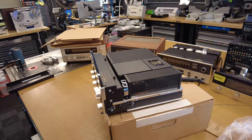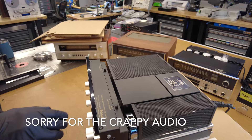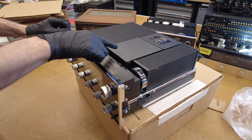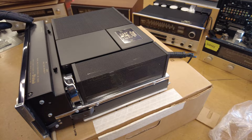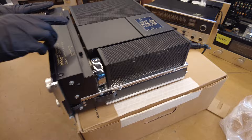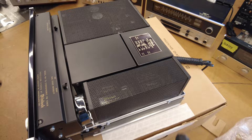I've got Ben with me. He's going to talk a bit about the layout and signal flow of the MR78. Underneath this cover is the front end. When you're spinning the tuning control, there's actually a set of strings that come across here and spin the actual tuning gang. After the front end, it moves to the IF chain. A cool thing about the MR78 is it has narrow, regular, and wide IF bandwidth, so you can fine-tune your IF to optimize it for the signal you're trying to receive. After that, we go into the detector, which is under this cover, and then back here is the MPX — the multiplex decoder — which is what decodes the stereo broadcast. And that covers the basics, along with the power transformer for the power supply.